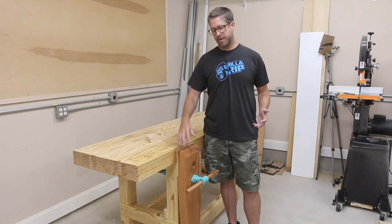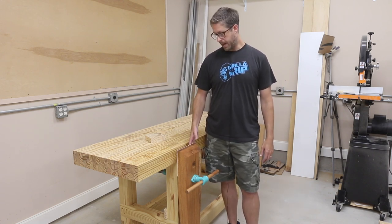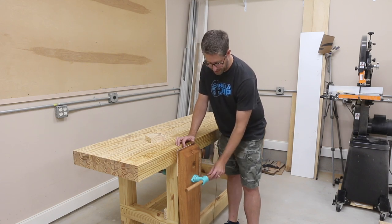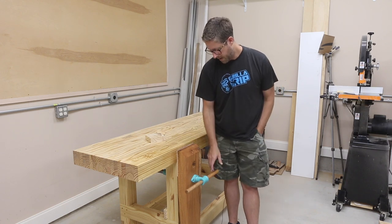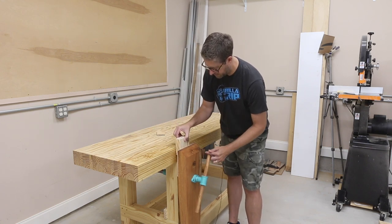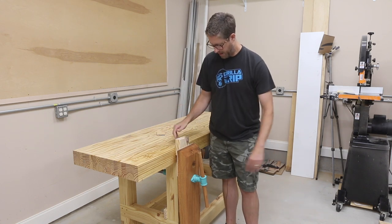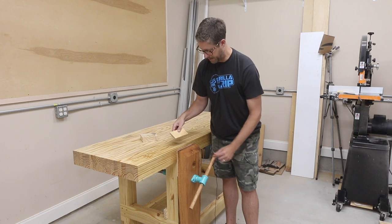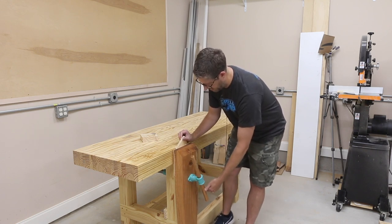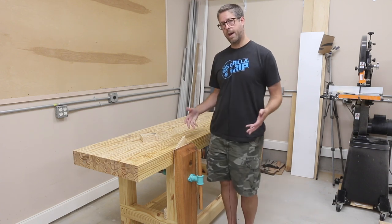I really love the way this thing came together. It functions great, it looks great, and I'm happy I made it. I've got a piece of leather here on one jaw so that I can grab the material quite well. I turned this piece out of the leftover cutoff from the leg vise itself and just put a couple of pan head screws in there so that it won't fall out. Two by material goes in there until it just engages at the top, kick the wedge in at the bottom, and about a quarter turn more and it's super sturdy. If you need to do different material, you just pull out the wedge, get your material where it engages at the top, kick the wedge in, and about a quarter more turn and it's not going anywhere. I love how that functions — this is a super simple way to operate this.